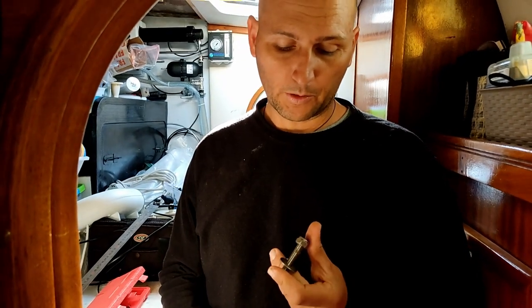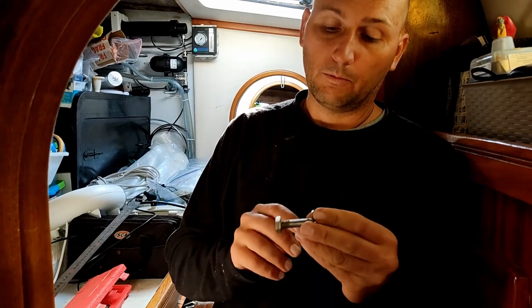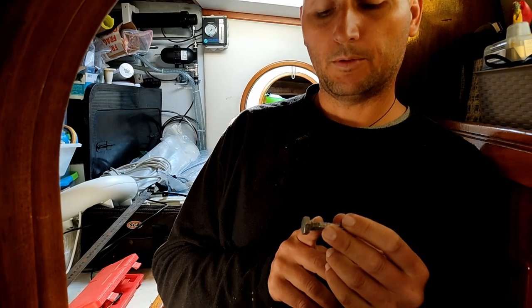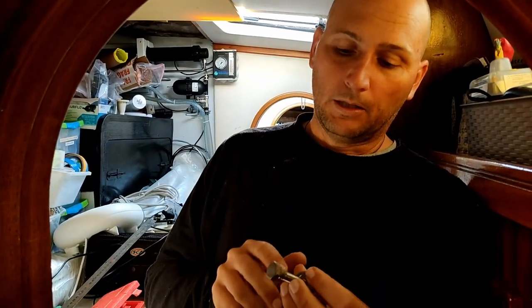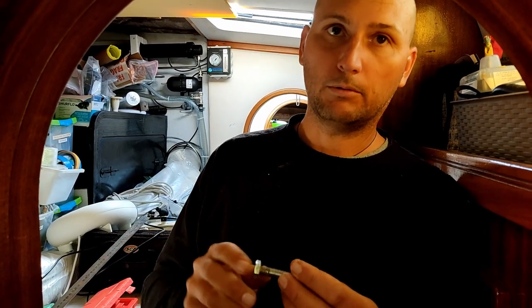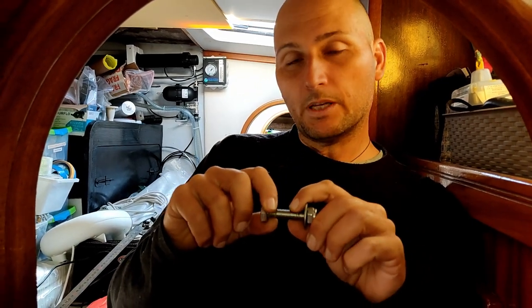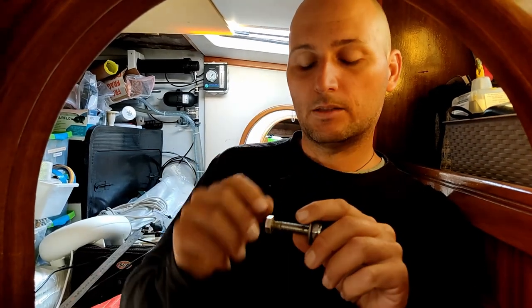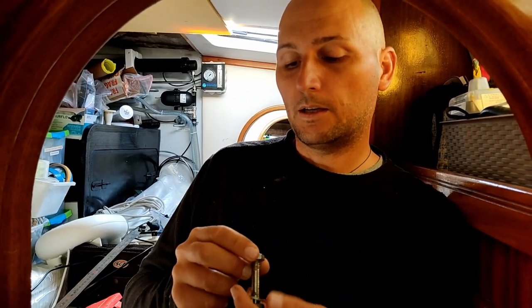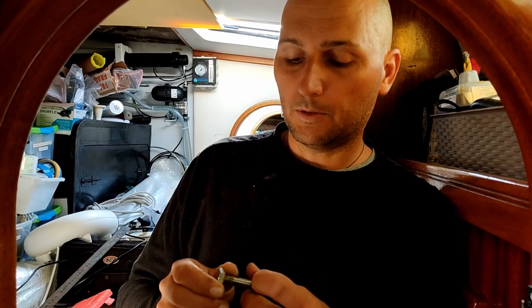One of the bolts for the chain plate — which is a little disappointing because it's a fully threaded bolt and not a shank bolt. What happens is these fully threaded bolts: they've got the stainless steel chain plate, stainless steel backing plate clamping the bulkhead, but there won't be any compression tubes in there. The thread of the bolt just turns into a saw and with cyclic loading on the composite bulkhead, it just chews into it rather than having a nice big smooth shank that bears on the bulkhead. They did use A80 grade bolts as opposed to A70, which was good, but being fully threaded is not ideal.